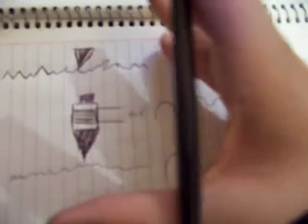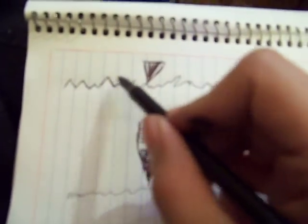When you move a magnetic field across a coil, it creates currents. So if the stylus along with the coil are moving up and down, that creates a current that varies according to the vibration, and this makes an electrical wave. Of course, those vibrations in real life are happening at very dynamic speeds. So this electrical wave is then fed into your amplifier, and your amplifier makes it bigger, and then that powers your speakers, and your speakers move back and forth in the same way also, and recreate that same sound that created these pits.